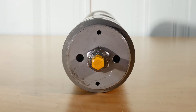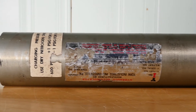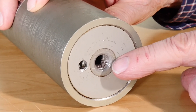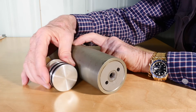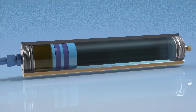The Hydrodyne Aerostar hydraulic accumulator is a steel cylinder with caps on each end and an aluminum piston fitted internally. The York model is similar but a little larger. When the hydraulic pump — either the engine-driven one or the electric one — starts to build system pressure, it forces the internal metal piston away from this end of the cylinder toward the nitrogen gas end.